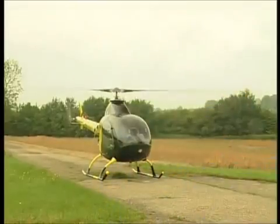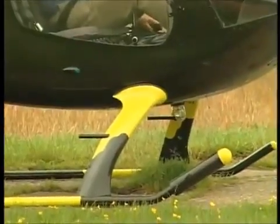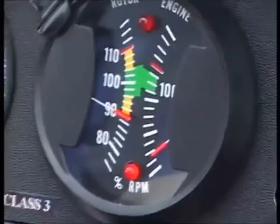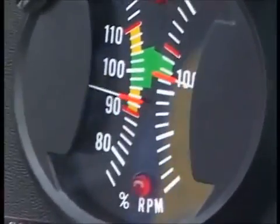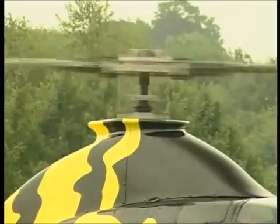So that's all cool, not a problem. We've got 100%. Now let's just check to make sure that the clutch doesn't drag down. So we've got the engine dropping down, RPM drops down, rotor RPM drops down on its own. That's cool. Everything's good. Let's get into the air. Off we go.